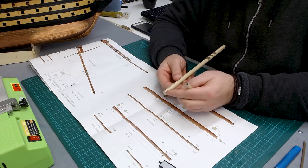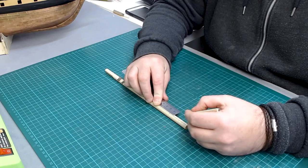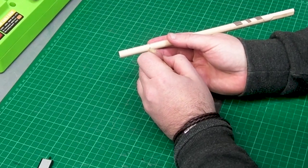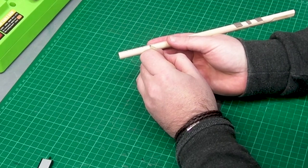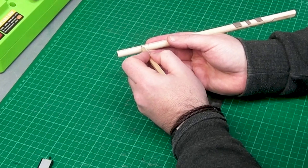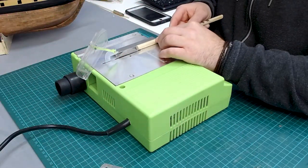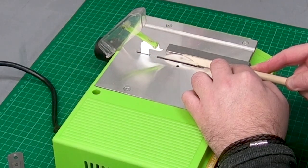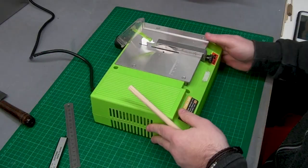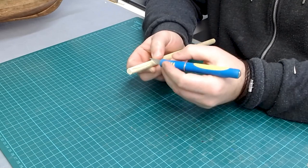I'm going to bring it over to the mini table saw to make a lot of these cuts. Ideally this cut would be better on a bandsaw or with a flat blade — I don't have a bandsaw, so I'm using the table saw. What happens with the table saw is the top part of the blade hits there and because the blade's curved it cuts like a half circle. It was cutting about five mil past the line, which is no good, so I dropped a line about 10 mil backwards and cut to that line so the curve won't go past the mark. After making these two little cuts you can see how it's longer at the bottom — that's why I made that mark to back it off.